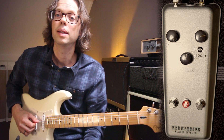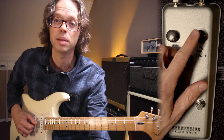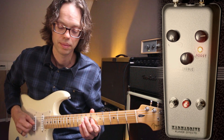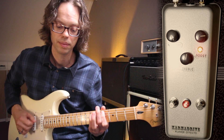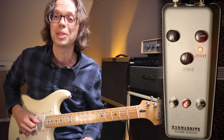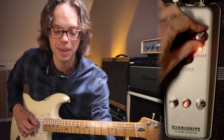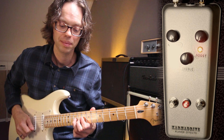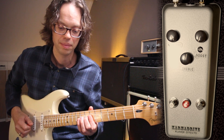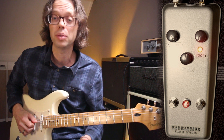Actually, it's not really a second channel — it's the same circuit, but the bias of the transistor is now adjustable by this boost button. It's adding a little bit of gain — actually, it's adding a lot of gain right now. Let's go into the range of this boost. Turning it off. Actually, right now it's also boosting a little bit.